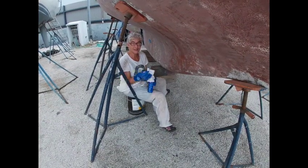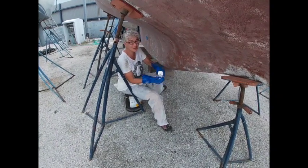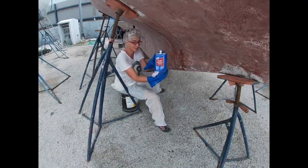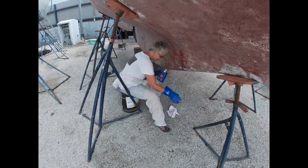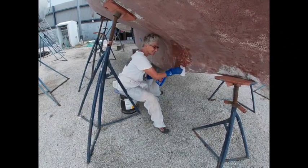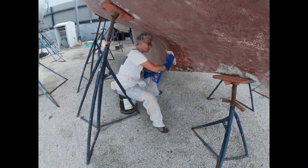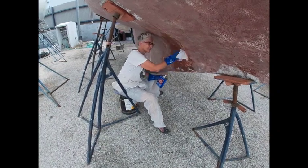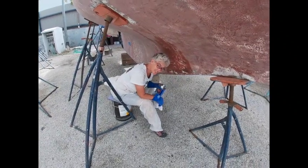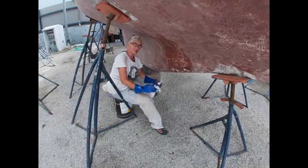I'm wiping the hull in preparation for putting the first coat of barrier coat on. I'm using the denatured alcohol recommended by Seahawk to clean any trace of wax or impurities off the hull. And I have filled and sanded for 2 weeks, and I am ready to do the barrier coat. I'm a little nervous about it,